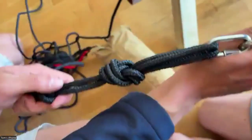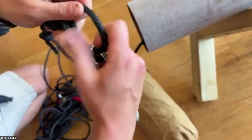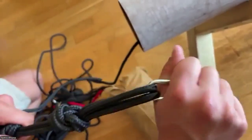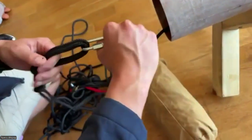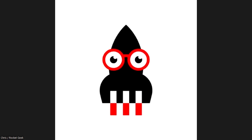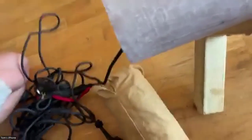We thought that would be more secure than sewing anything, considering it's a circular cord as opposed to a flat 1/2 inch nylon, which we used previously. But this was lighter weight with the same survivability. Although obviously it's less elastic, but that's where the extra length comes in to attenuate some of that load during deployment. Kevlar doesn't give. Why did you tie that extra knot versus just taping that in? Just additional security. We'd rather be overcautious than anything else.